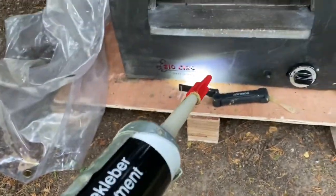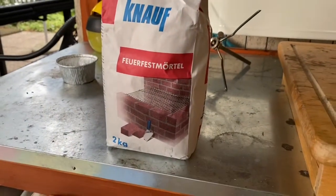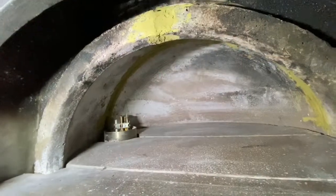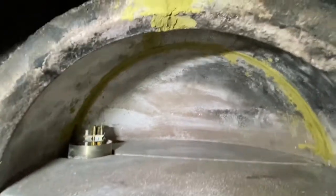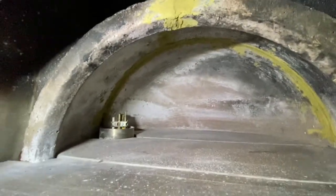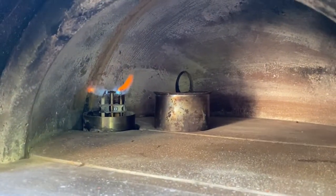I got a can of fire brick glue for the dome and a package of fire cement for the bottom. I applied it with a scraper, let it dry for 24 hours, and burned in the oven again with a few fires. Fortunately, the gas burner was fine and survived the crash safely, so I took a few small fires from the gas burner.